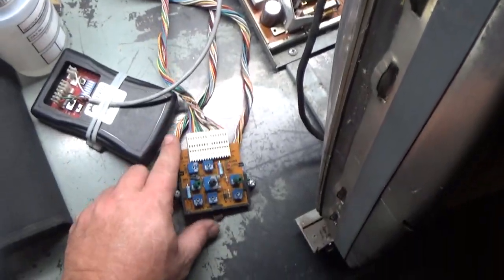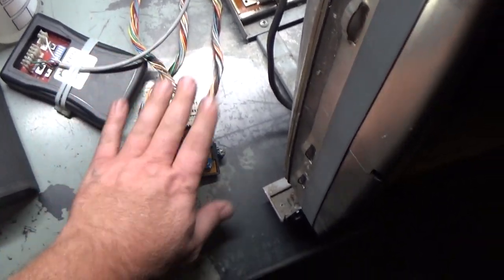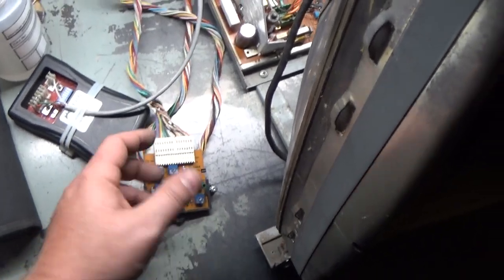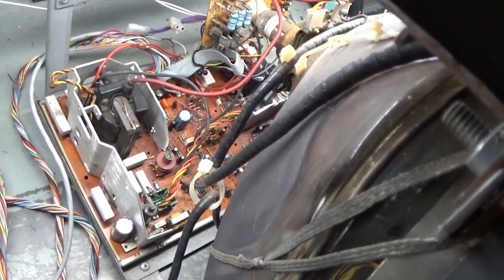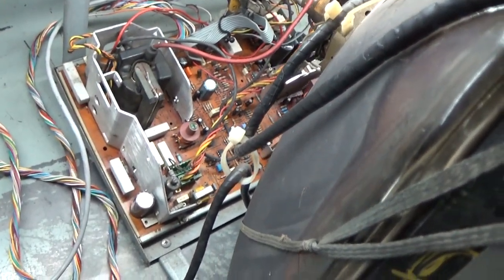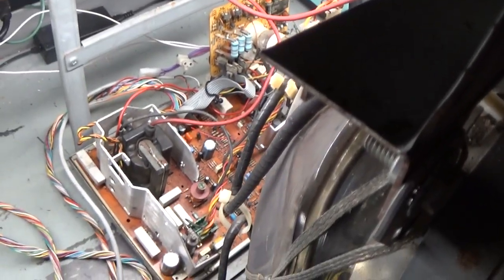Okay, we got our test pattern generator hooked up: remote board, anode, neck, yoke, ground, power, video, and I already mentioned remote, so there's our 7. So let's see if it even works now after changing the flyback, reflowing those solder joints in the power supply section, and kind of go from there. All right, so here we go. 1, 2, oh, there we go. 1, 2, 3.